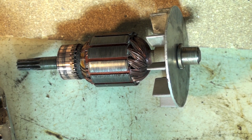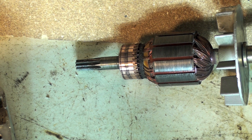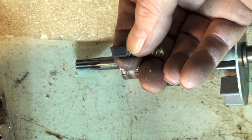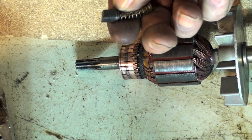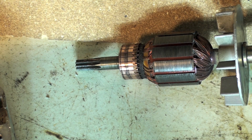This is the common small drill-type motor and other small motors that need high starting torque. They're not used for bigger applications much anymore — the biggest I've ever seen is about three-quarter horsepower, and that was a very old motor. They're generally replaced by induction motors for larger applications. One important note: the brushes wear out, which is one reason we've moved away from them. They also make sparks as the motor rotates, so they can't be used around volatile gases. Sparking and brush wear mean they won't last as long as induction motors, but they do have high starting torque — just not high efficiency — and are used mostly in small applications.